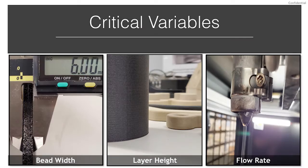Let's review some critical processing variables. Before printing an actual part, there are a couple of critical variables that need to be established. Nozzle diameter, bead width, layer height, temperatures, and speed — these are variables that will dictate flow rate and your throughput, strength of your part, and even the quality. Most slicing software packages will let you review the toolpath in a simulation format after you determine these variables. The operator will look for any problems throughout each layer, making sure the features can be produced and ensure efficient printing.